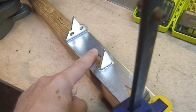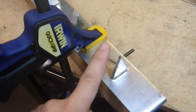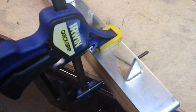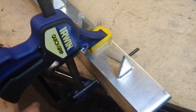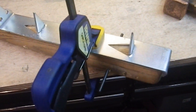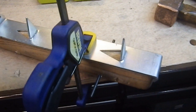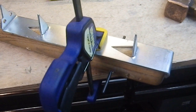I will use this to help me line up this hole perpendicular to the first set. Then when I have that hole done, I will remove this and put it here and line the vertical up with the drill bit and the drill press to drill this hole. It's a little complicated, but I don't have any kind of fixture. I have an idea for a fixture that would let me drill holes in a row — I used to use one at my old job, but I have to figure out how to make a version of it because I don't have the same tools. So now I can make the marks, brighten them with an awl, and then drill the last two holes and start assembly.